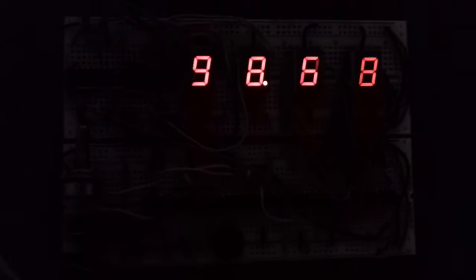If you want stable counting, you could use a microcontroller to clock the circuit instead of a 555 timer, or use a frequency generator or dedicated clocking device. You could use 100 Hz for clocking, or maybe 103 Hz to account for losses in the circuit. As you can see, I can adjust it to count slower and sync it up with my phone's stopwatch.